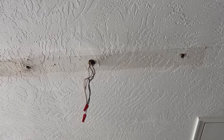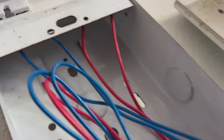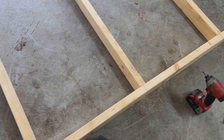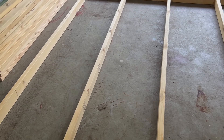We removed the strip light and just capped off the wire so it'll still work. You can see the imprint of where it was — it's been there for 30 years. Here's the fixture with the T8 program start ballast. The first section of the wall framework is finished — 8 feet long and 8 feet 4 inches tall. This is going to be the first section, and then we're going to make a 4-foot section and another 8-foot section for the last part, which will need to have the door frame.